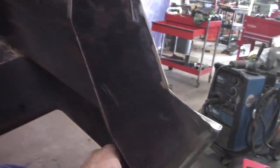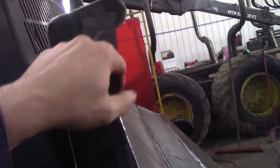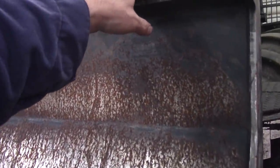You gotta like it. So one more thing when you're welding. I think I mentioned it earlier. I take the blending wheel and I knock all them sharp edges off of here, where they hook stuff. I gotta do this top edge first yet. It's just something I always do. You're gonna grab onto that, or if they throw chains around it, whatever they do. But I like to take the burrs off, because the last thing you want to do is fall on it or grab a hold of it and then cut your damn hand open.